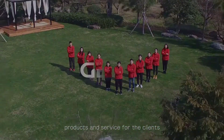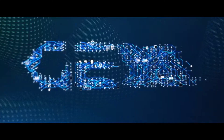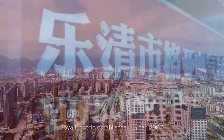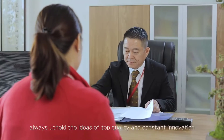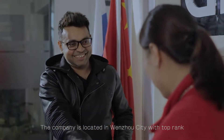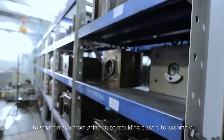5. Under-Voltage Protection Value Range: 150V–219V Adjustable, Default 160V. Under-Voltage Recovery Value Range: 151V–220V, Default 180V. Under-Voltage Protection Action Time: 0.1–10 seconds, Default 0.2 seconds. 6. 3-Phase Volt Unbalance Protection Value: 10%–50%, Default 20%. 7. 3-Phase Volt Unbalance Protection Action Time: 0.1–10 seconds, Default 1s. 8. Delay Time After Power On: 2–255 seconds, Default 2s. 9. Recovery Delay Time: 2–600s, Default 60s. 10. Display Model: LCD. 11. Dimensions: 72×65×80mm. 12. Installation: 35mm DIN Rail.